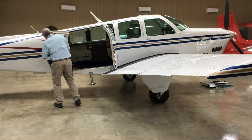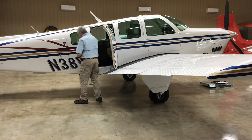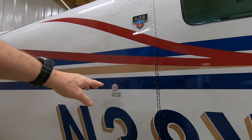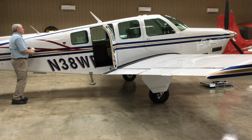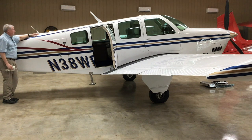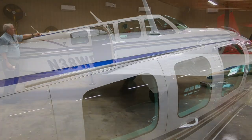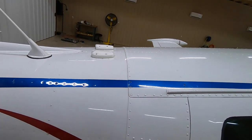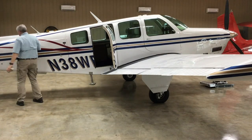I'm going to close this door because I want to look at the static drain right here — make sure that's clear, that's important. I look at the top of the fuselage; mostly I'm looking for dirt, damage, dings — something not normal that we need to investigate further. I look at the antennas: I've got GPS antennas back here for the Aspens, GPS antennas up there, the COM antenna, the ELT, and another COM antenna below the airplane for number two.